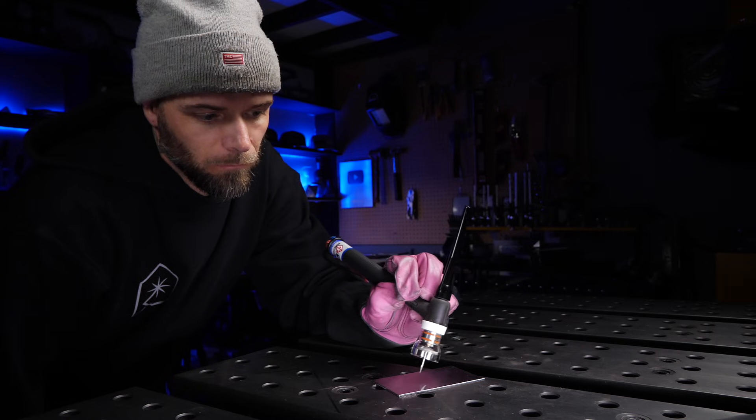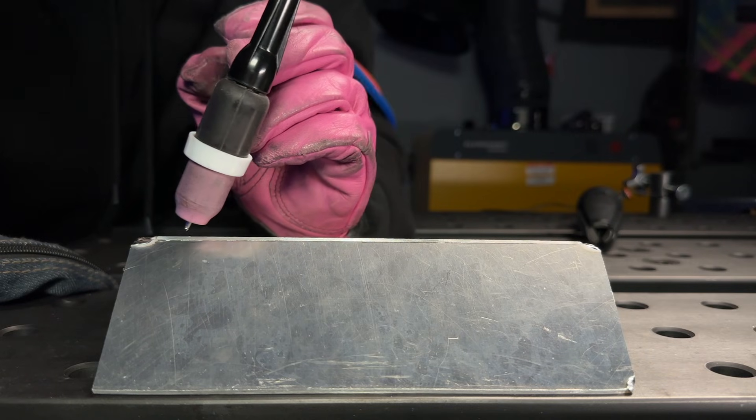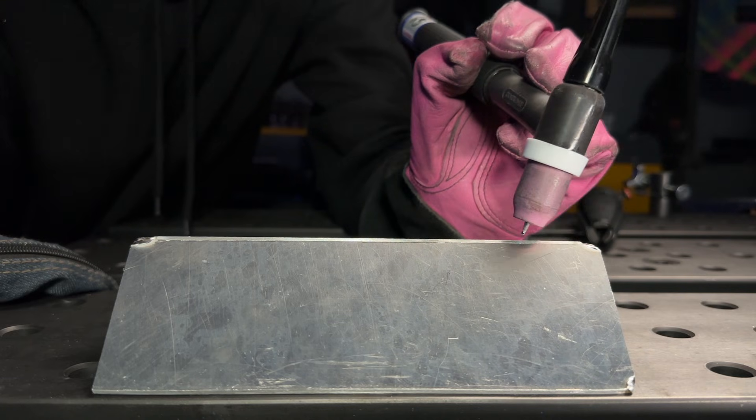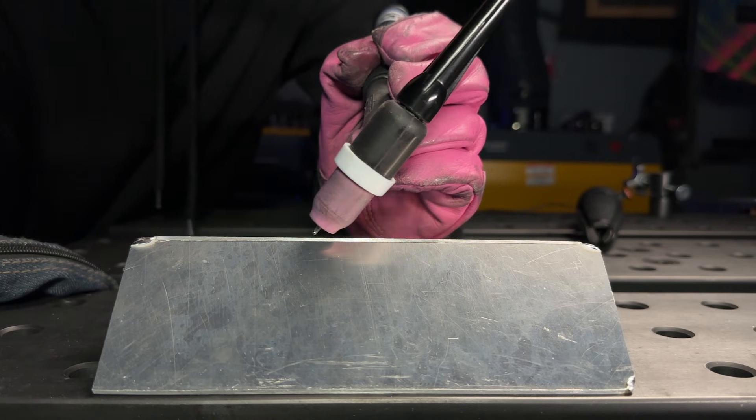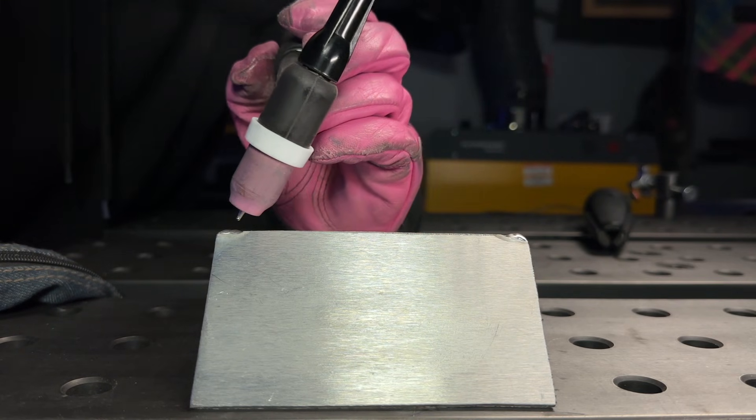As you start to build overall comfort and familiarity with all of the exercises you are practicing, you're going to start to get more comfortable and confident with the amount of travel, and this is when you can start to increase the distance. What we want to do is maintain a perfect travel angle with your torch from start all the way to the finish. What is common is that somebody starts out with the perfect travel angle, but by the end the angle looks a bit different. We want to avoid changing the angle from start to finish — focus on remaining completely comfortable and maintaining perfect technique with your angle throughout.